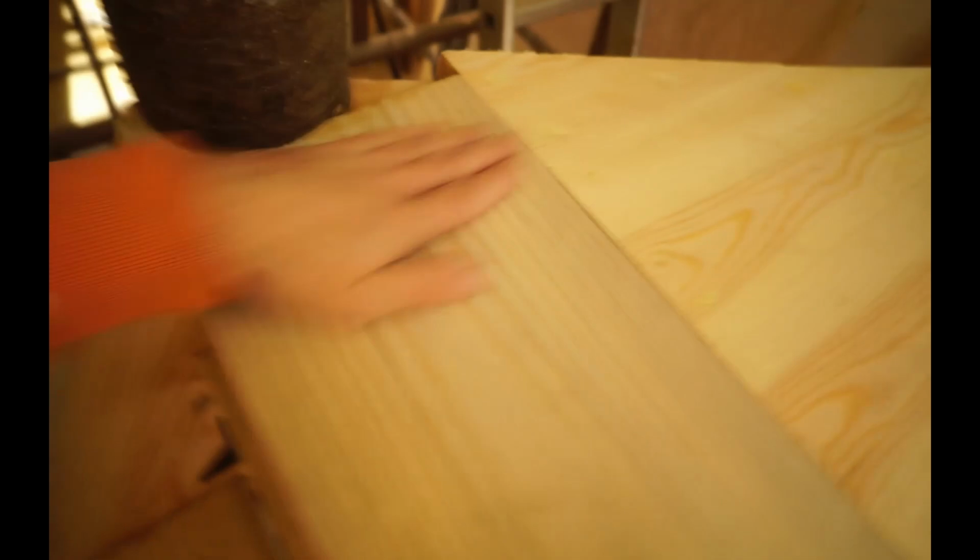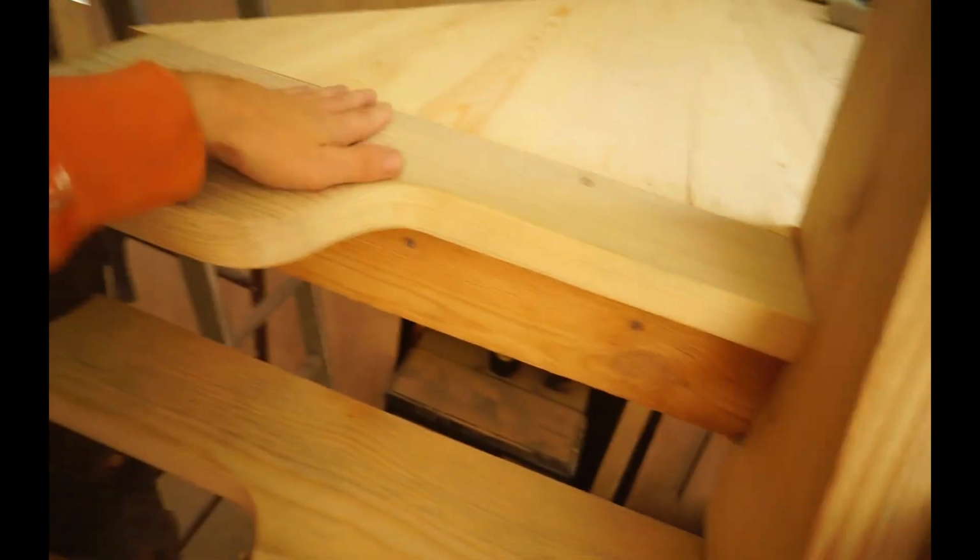So slide this in. And like I say, we've got a good seating on all of that. Nice flush fit there. Oh, it is now. And it's all nice and level. So I'm going to nail this down, same as my floorboards, with these floorboard nails, and then I can tap the heads in and fill them. I'm also going to put a couple of these long nails through the bottom of this step up into this. And then fill all my little gaps. I can get some oil on.